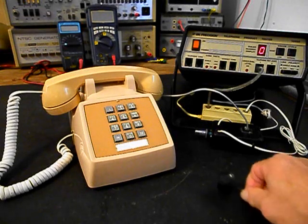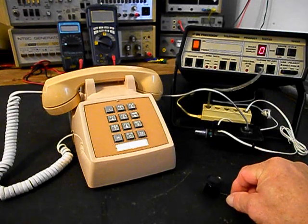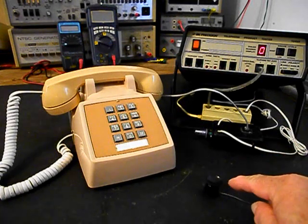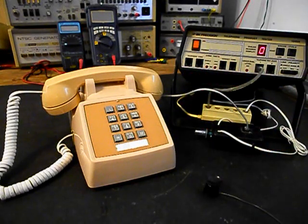We also want to mention our amplified pickup. We use this pickup in troubleshooting, repairing, and on our final checkouts. It's amplified so that you can hear the audio from a receiver. And I have an amplifier back by the video. It has a button on it. When I press the button, I can give dial tone or take it away at any time. And since it's an open amplifier, it is prone to any static interference or noise in the atmosphere. So we want to go ahead and press the button and see if we hear any electrical noise.